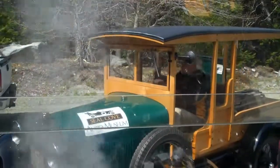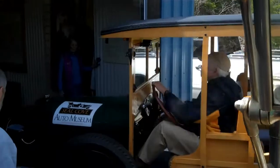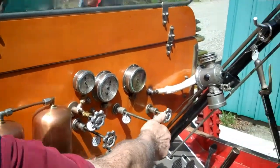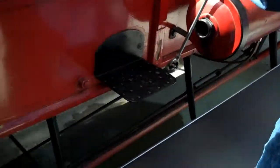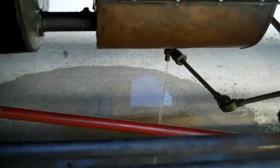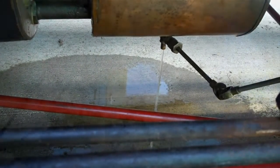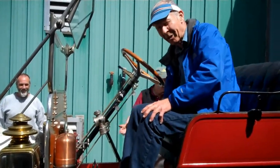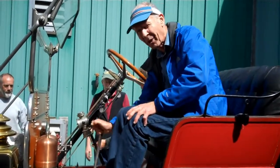Might be put out up here. Okay. As a vapor? Yeah. Oh, I like that sound. This is the drip opening valve. It's open during startup to remove any water from the cylinder. Water pressure at 120 psi manual. Once it gets moving, the pump will maintain pressure.